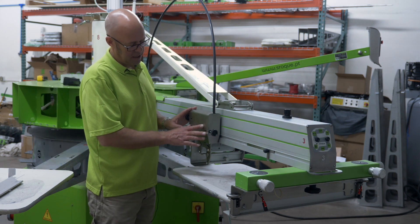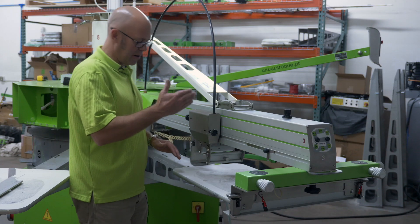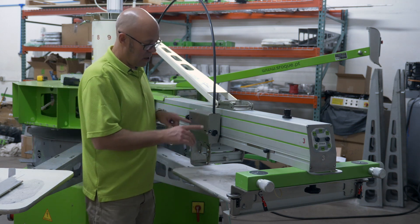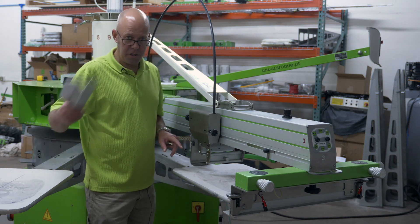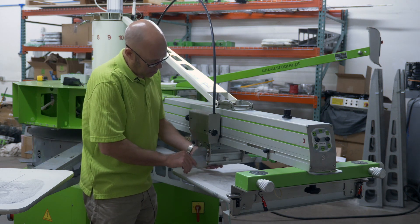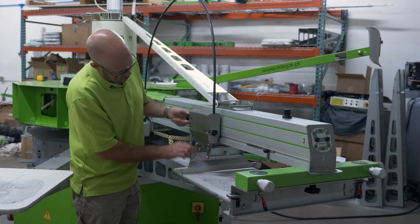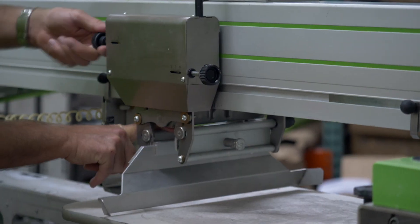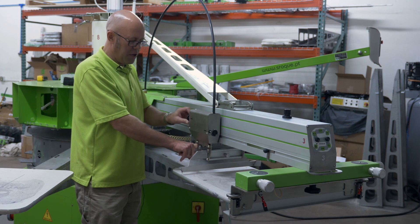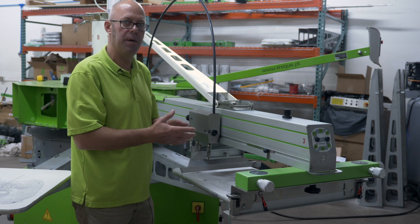The second thing is our distance settings. There's a gauge on both of these dials, zero to two — zero meaning closer to the pallet, two meaning higher than the pallet. These adjustments control the distance settings for your flood bars and squeegees. If my squeegee is down on the pallet and I adjust towards two, you can see the flood bar raising. By using your distance settings in conjunction with your pressure settings, you can achieve the best print possible.